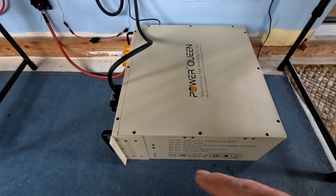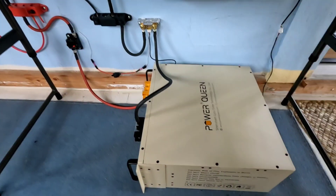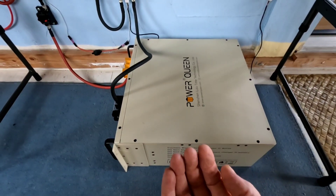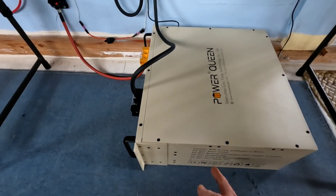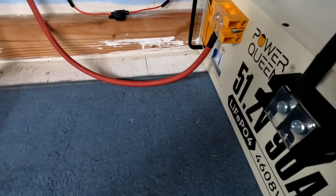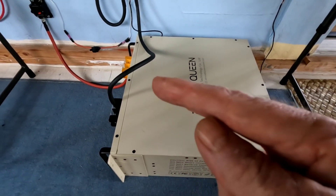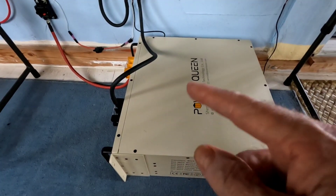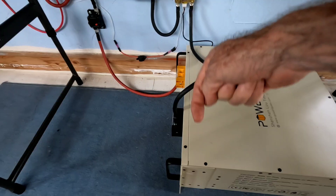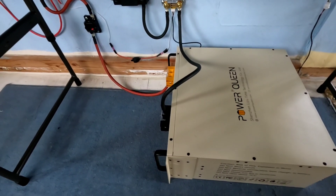I'm sitting up at a tabletop right now — I've got all of this mounted underneath a table. What I want to do is turn the battery around so the front with the battery cables is facing out this way, making it quick and easy to flip the switch off. To do that, I'll cut some two-by-fours to the exact width and set the battery on them, giving it about a two-inch boost above the ground. Then I'll run three-foot cables underneath the battery and up to those terminals — that'll look pretty nice.